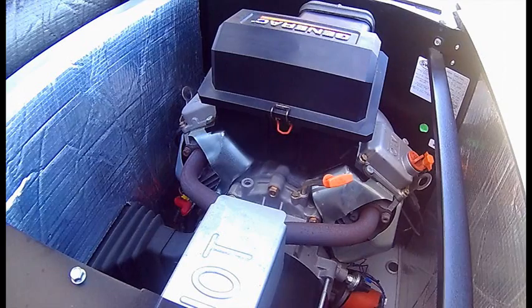So this is it. If anybody's interested in getting something like that, there are quite a bit of options, especially from Generac. Like I said, the load shedding option. If you buy yourself a smaller generator, something like a 16 or 13 kilowatt generator, you can add load shedding capability on the transfer. The transfer panel has built-in load shedding capability.